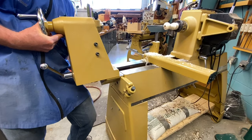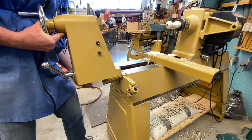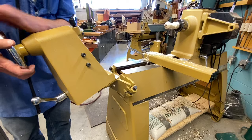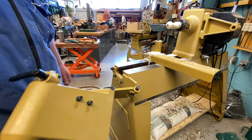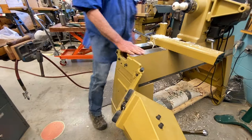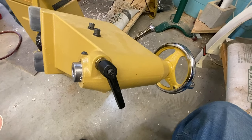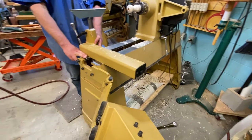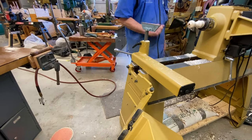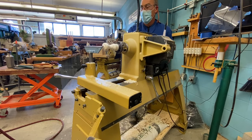But the swingaways, again, the guild supported us on this purchase, is that I had nightmares one night with regards to seeing students pull these off and having to lift the tailstocks from here to the bench and having them land on their feet. And that sent quivers and a couple of sleepless nights. And so I knew it was definitely needed to have the swingaways. So, bringing the banjo, I like putting two fingers down, right about here. That's a good distance for the banjo. Turn the tool rest, and now I know where to go. Point A, point B. There we are.